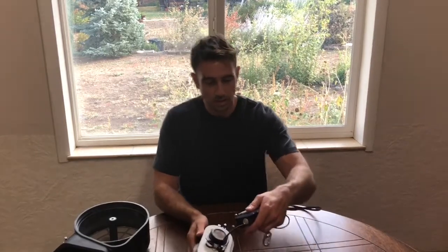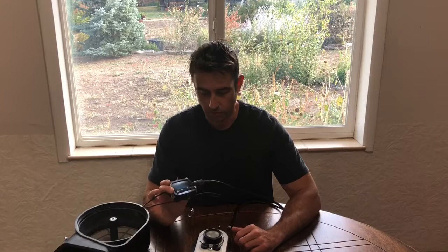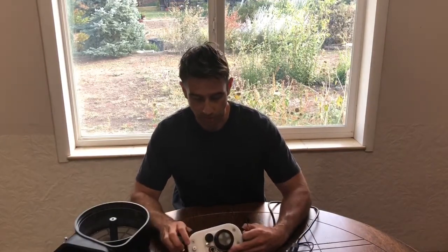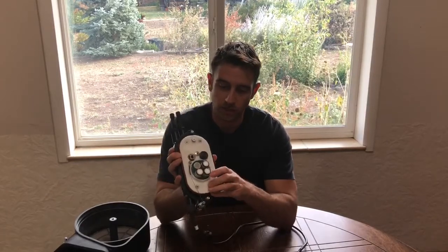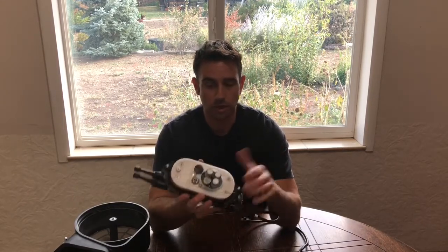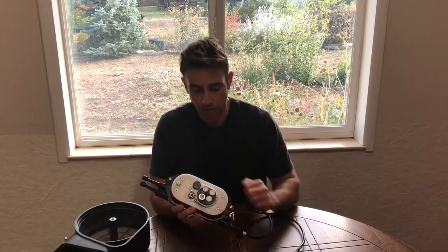Let's take a look at the electronics head now. It comes with this computer — this is the controller from Lungfish. This is what you use to turn on the system and make adjustments. There's also a data port you can open up here where you can plug in a computer cable and attach it to your PC to make adjustments and download data that way. Underneath this portion — we can pull this off — is a screen that protects the three oxygen sensors. This fourth item over here is actually a CO2 sensor, which is not considered a replaceable item and should last a long time. The oxygen sensors need to be replaced about once every year. The round spot you see is a plug you can pull out — you can actually put a fourth oxygen sensor in if you choose to.